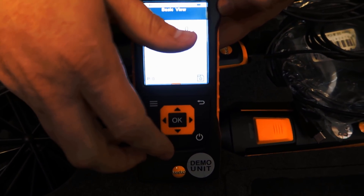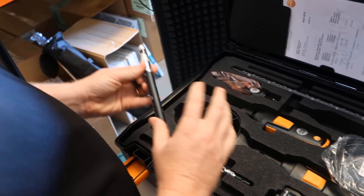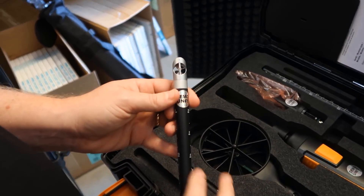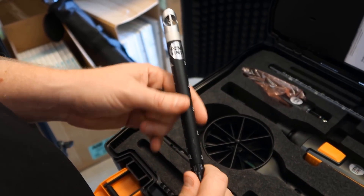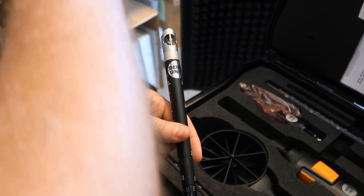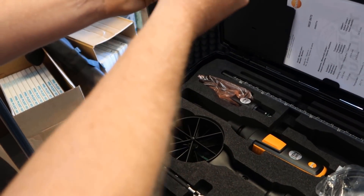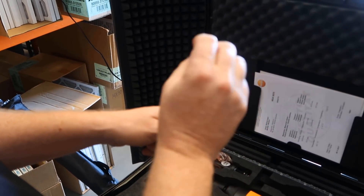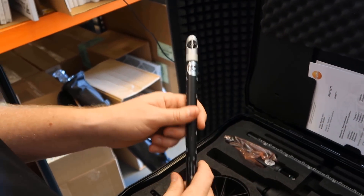They have a lot of additional features you can utilize as well. We have this mini vane — each air velocity measurement device has its advantages and disadvantages. The mini vane can go into a duct and measures accurately in that middle range. It doesn't rely as heavily on the traverse. In a traverse, you insert it in the duct and then slowly pull it out — inserting all the way in and slowly pulling it out using the time traverse method. Because the mini vane has some inertia to the blade, it's not as affected as a hot wire is for small changes in airflow.